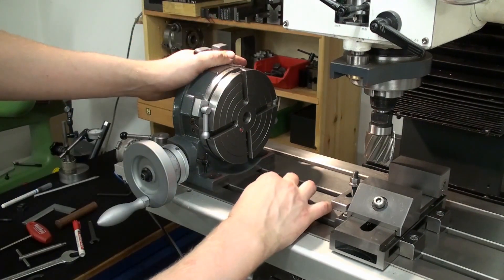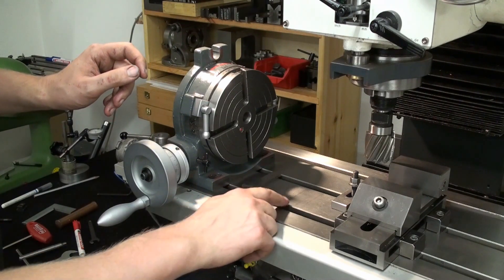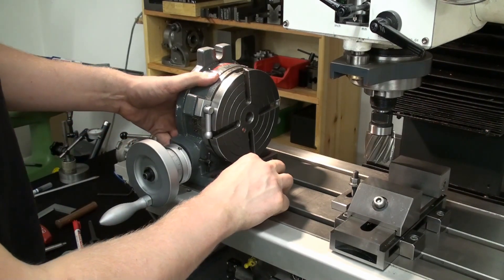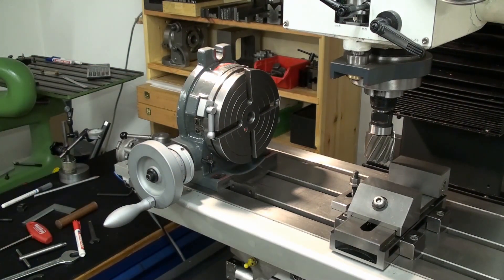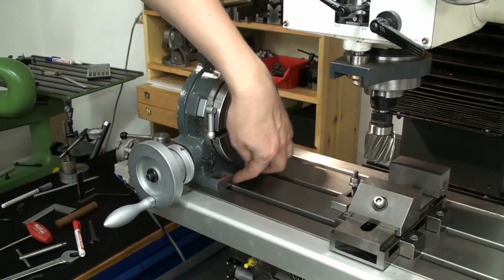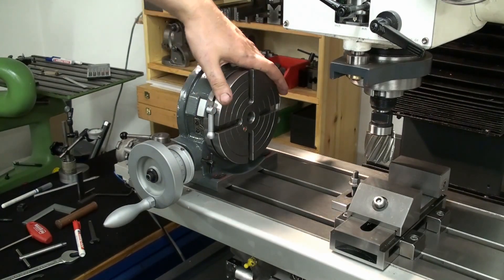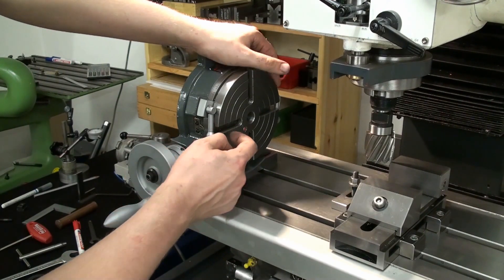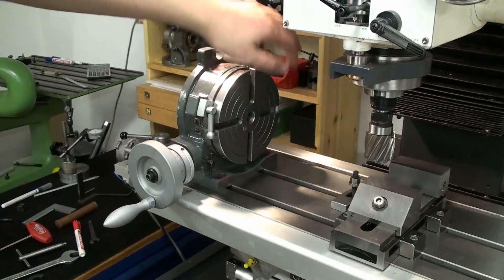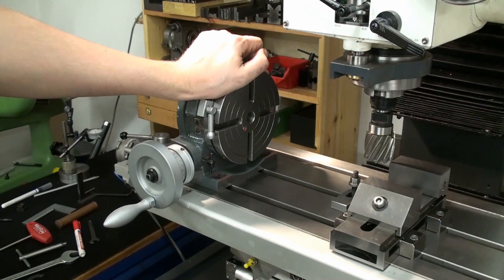Now we're back on the milling machine and I can show you why I did this. I have a machinist square that I can set up against the edge of the T-slot, and I can bring up the rotary table with the machined surface against the square to rough-align the table within seconds. Then I remove the square, set up my strap clamps, and run the indicator from side to side to dial it in perfectly. This is one even surface that's way easier and way better to indicate than the faceplate of the rotary table, which has grooves, T-slots, center bore, and all kinds of interruptions where the indicator will jump. That's a nice small improvement on the rotary table — maybe it's helpful for you. Thank you all for watching and see you next time.